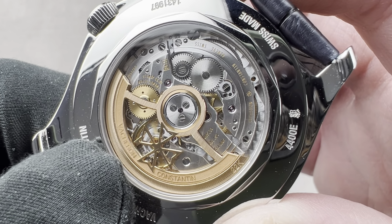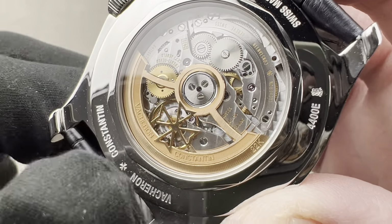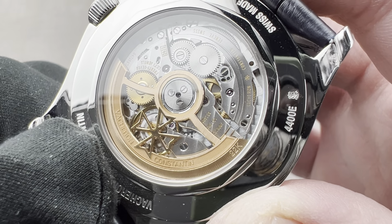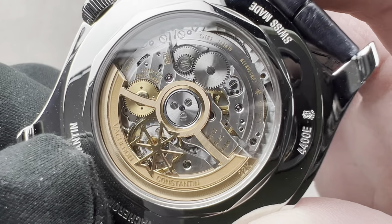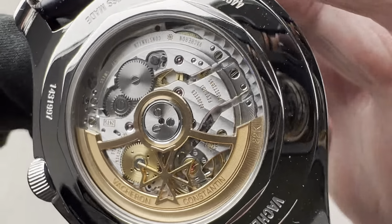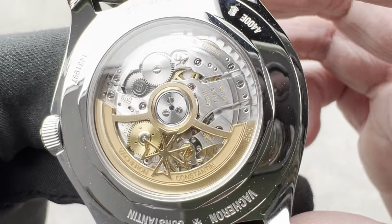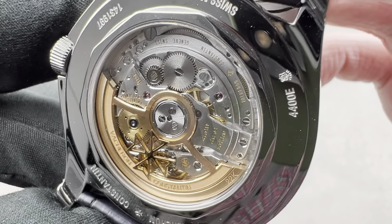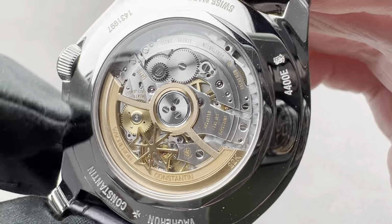It's reference 2475 SC2, automatic winding with ceramic bearings for higher efficiency. It's got a 4 hertz beat rate, a 40-hour power reserve, a day-date power reserve indicator, Geneva hallmark finish, 27 jewels, and a 5-position adjustment. Geneva hallmark finish is codified, stating that there are standards of finish that a movement must meet to receive the seal, but first it must be assembled and finished within the city or canton of Geneva, and since the 1880s it has been codified excellence.